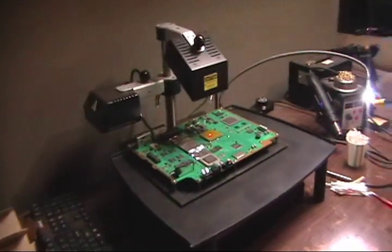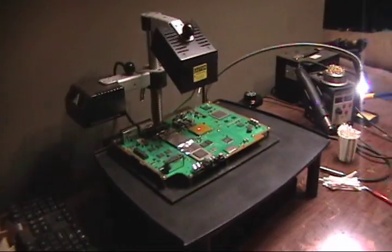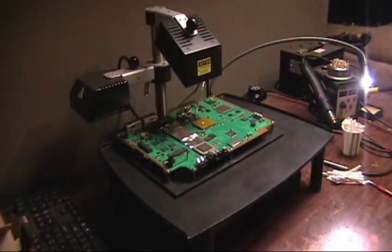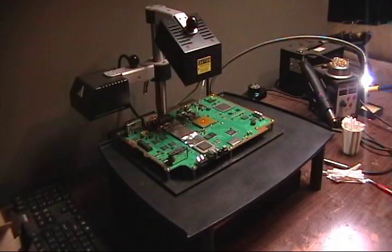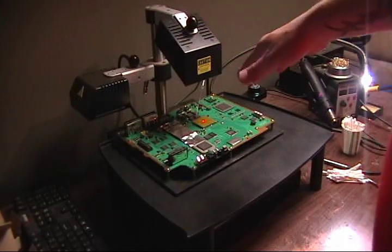And when it gets to 90 degrees I turn the upper heater on fast reflow, just so I can let it start warming up. With this setup, I leave my upper heater on level 4, and when I swing it over I drop it down to 3.